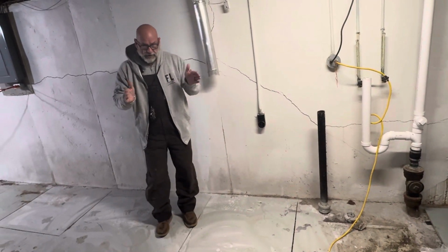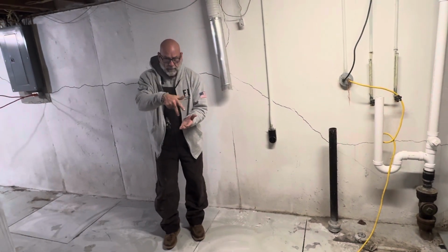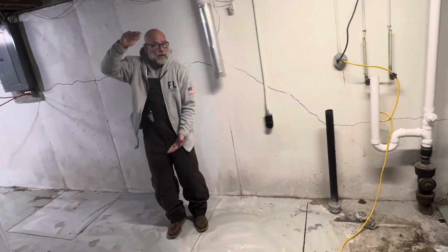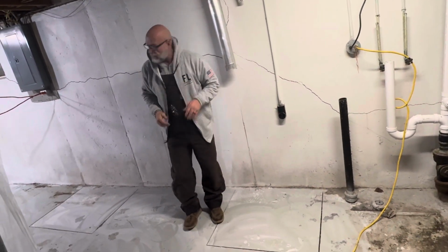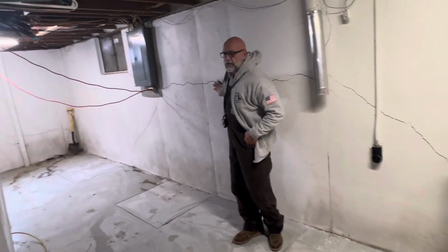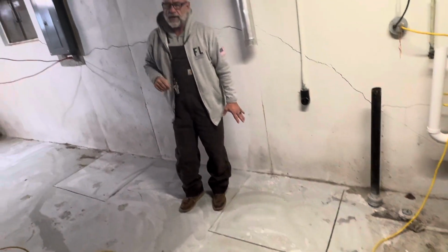What you have around your little 2 foot wide, 8 inch thick footings with 2 runs of rebar in it is 4 feet wide, 6 foot in length, and about 21 inches of high strength concrete encased around that little footing in every location where the King Pier is located. So we've got 3 on this floor right here under the footing. On the east wall, we've got 3.